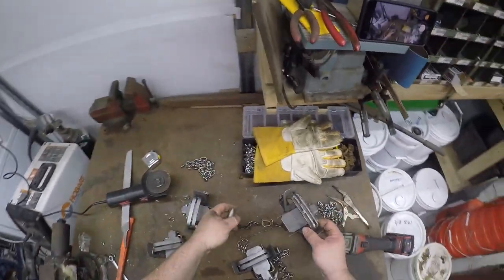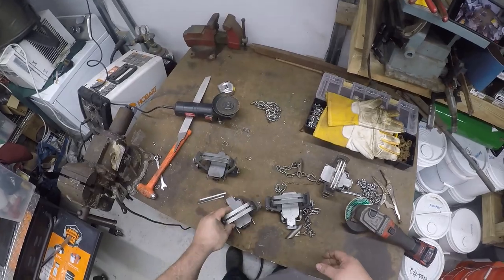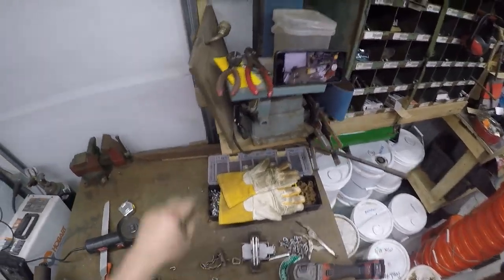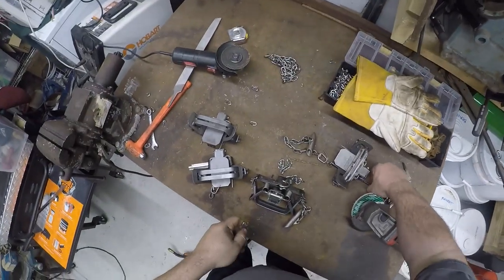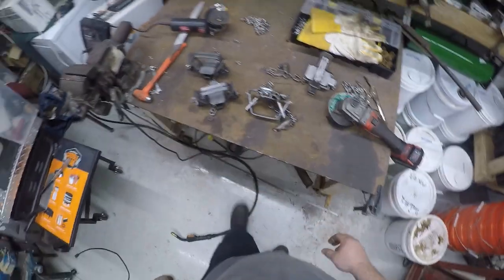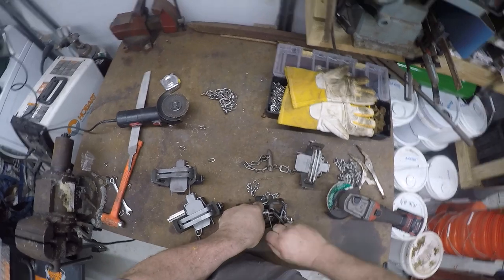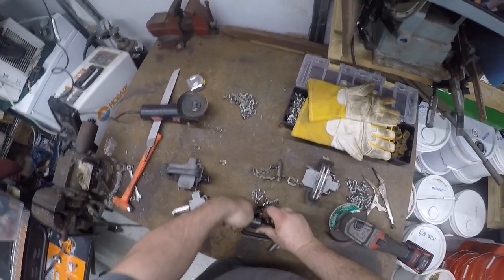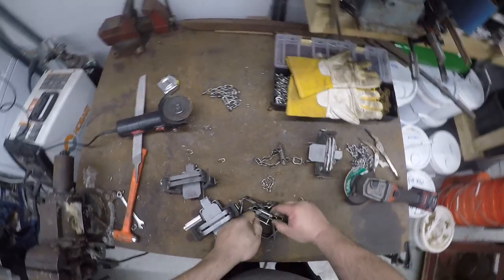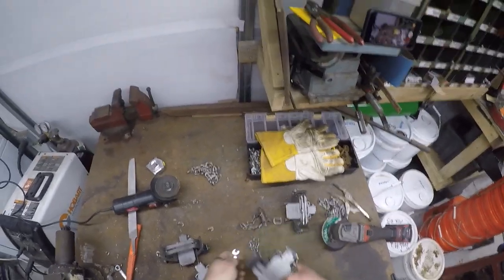So what we're going to do today is take them from here to here. What we'll start off with is getting our pans tightened. We're going to tighten these pans up, get the preload on them. Just run all the slack out of that adjuster bolt and then back it back off. Just a half turn. That'll get us till we set in the trap.